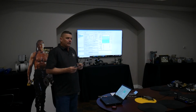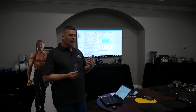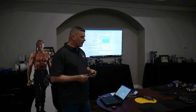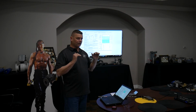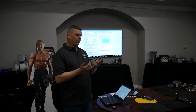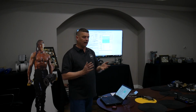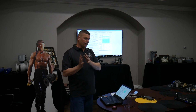Okay, under normal situations, if you're making a cut that's beyond the 20 pounds with these regulators, what you're losing in capacity is maybe a pound or two. You can see it obviously on a gauge, and this is why, good question actually, if I'm in a system where the pressure cuts I'm making are relatively shallow and I'm doing a worker monitor, let's say I only had 35 pounds of pressure cut to make, and I'm setting my worker at 60, worker inlet is at 60, or both the sets at 60.